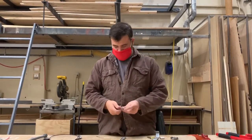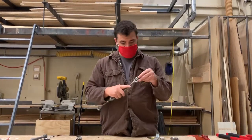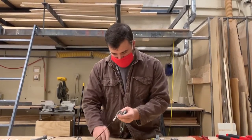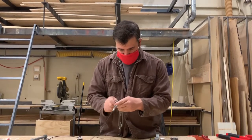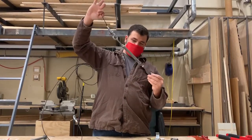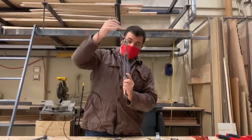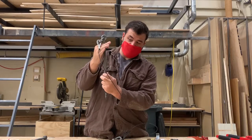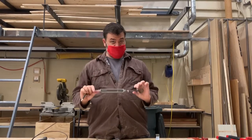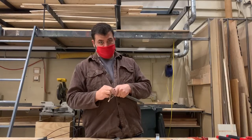You can build one of those to show how they go — we'll go bigger because it's more fun. Build that through, hook it. So this would be an example of how to use this turnbuckle; it's a little big but it'll work. So that hangs down, and if the flat is here to adjust it, all we have to do is hold this and rotate these out. This one will give you about four inches of adjustment, which means you'd have to be really off for it not to work.